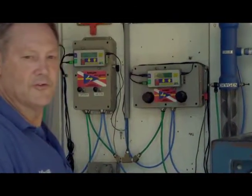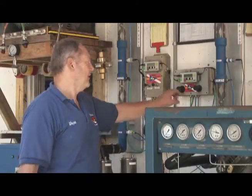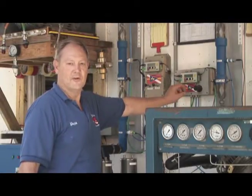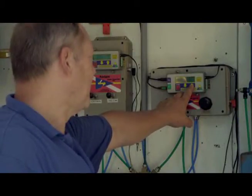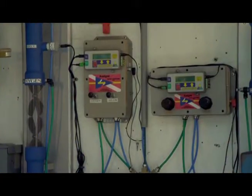When the box reaches the 39% or almost 40% that shuts it off, it will put a message up that says oxygen level is too high, and up turns on the gas. So since the box is shut off, you'll then have to touch the yellow up arrow again to turn it back on, and then it will give you the oxygen reading that it has.